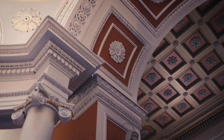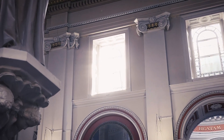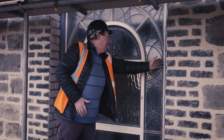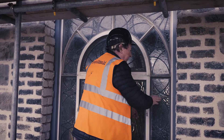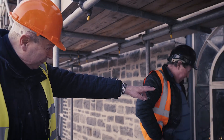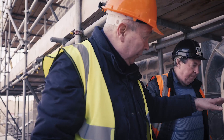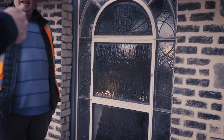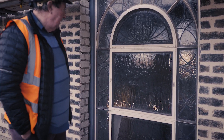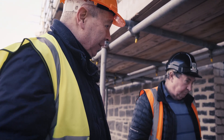We've also renovated the windows. They are steel windows, so they've been completely renovated, repainted, reglazed, and cleaned — you can see a lot more light coming in now. The reveal here is prepared for render, with all new timber reinforcing the window structure. The top section is bottom-hinged, there's a center pivot, and the bottom one is on a ratchet. We're eventually going to operate these with an electric actuator, allowing us from maybe May to October to keep the windows open and allow ventilation in the church — which is very important in buildings of this vintage.